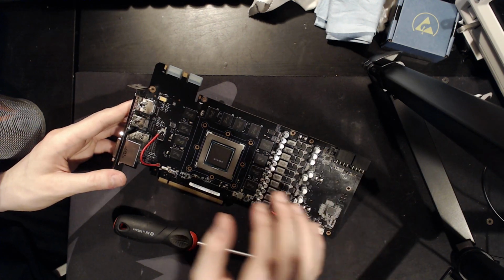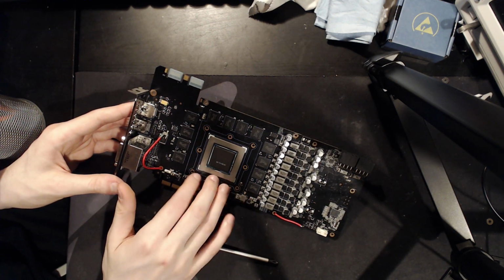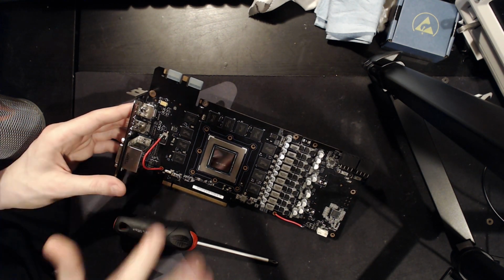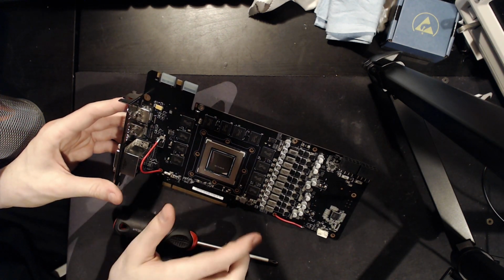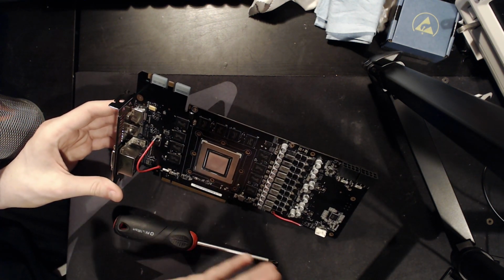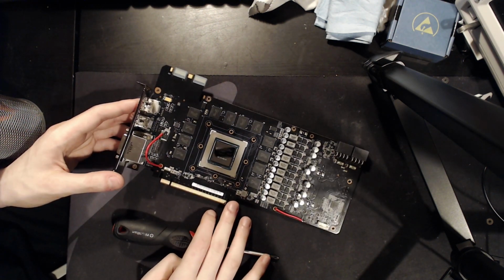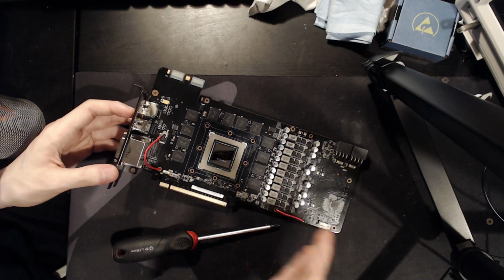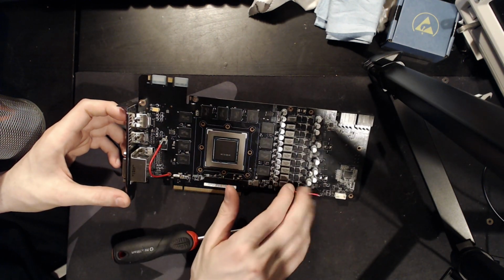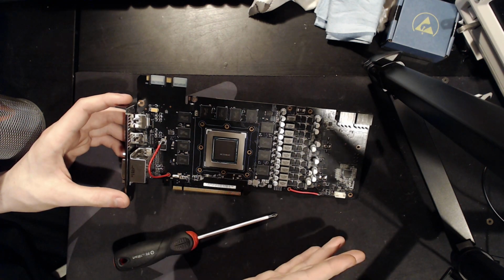I'm definitely going to test both cards on the Morpheus air cooler, but I'm not thinking about running it on LN2. I'm thinking about doing it on dry ice, with this card and the 780 Ti Classified I have, both of them. Dry ice is not really cheaper for me than LN2, it's just much more readily available. It's not on a 6 week delivery cycle. And the other thing is, it's easier to work with, as 780 Ti's have a cold bug at like minus 100 or below that even. So I shouldn't have problems with the card randomly shutting down on me.